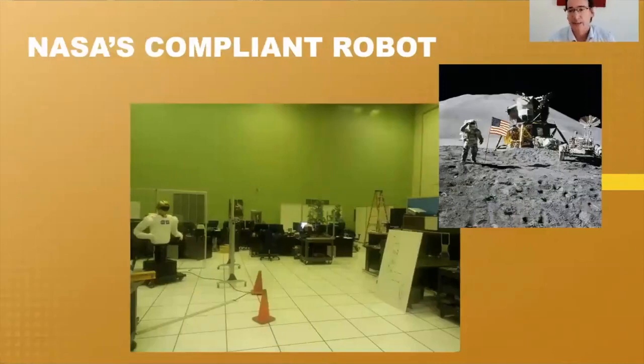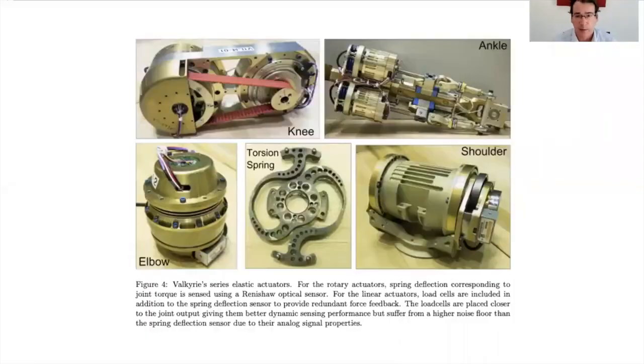In 2012, we were hired by NASA to help build Valkyrie. This was exciting because we were in an environment where great space systems have been designed. We spent close to a year and a half designing low- and high-level controllers, working with NASA to incorporate some of our mechanical ideas. Here are some of the things that came out of this — various types of actuators for Valkyrie. Some were based on classical designs with torsional springs, but on the upper right side, you see our UTC transformed into a NASA product, with the same idea of the ball screw and ball nut being driven by the motor.